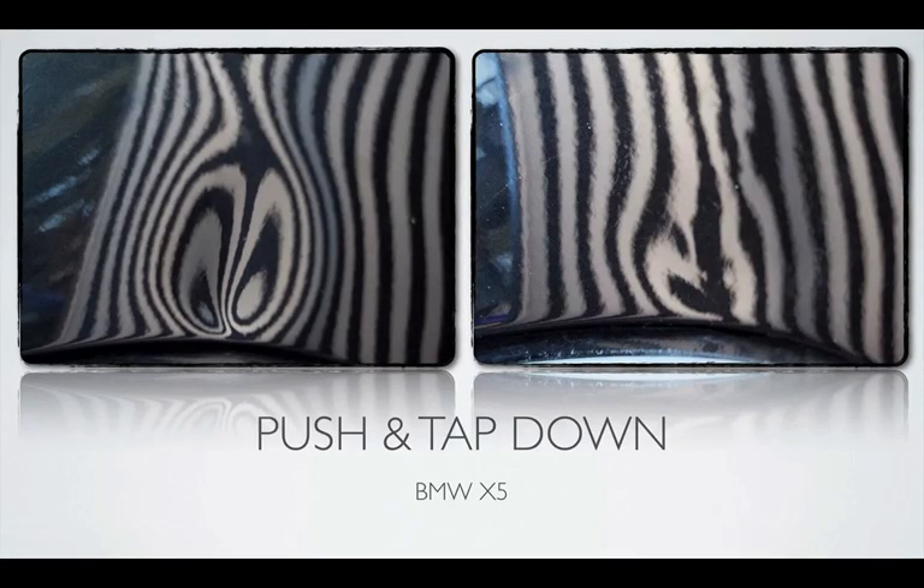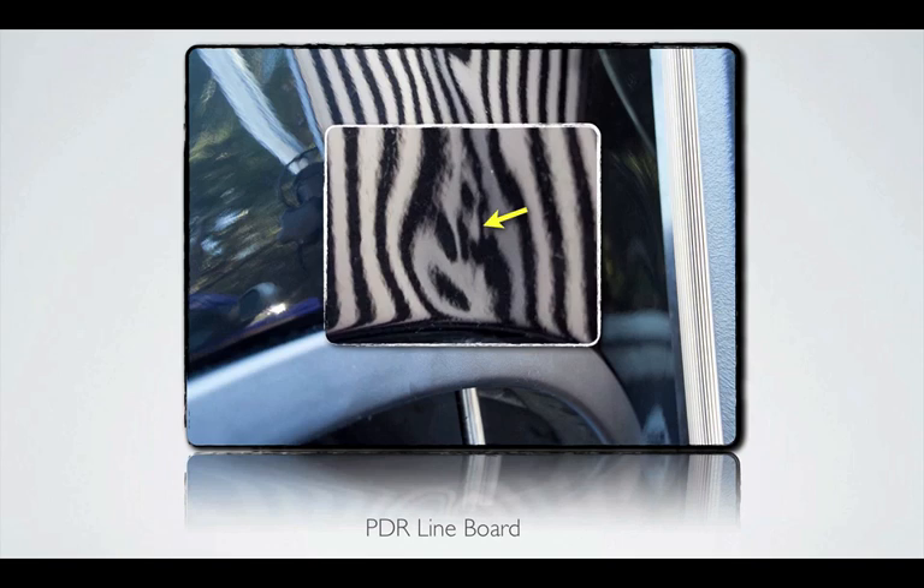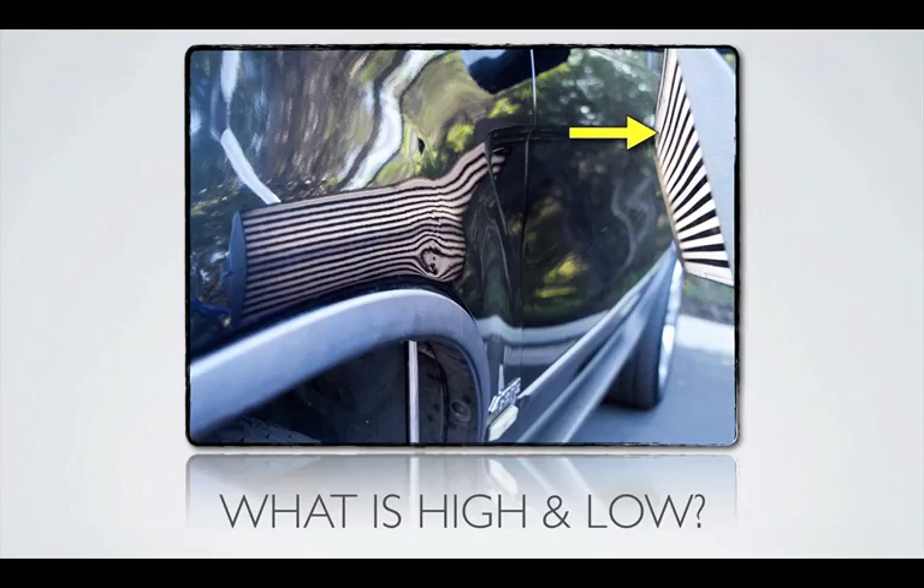On the next slide you can see that I did a little bit of both — I did knock down. You can see a little tap-down marks if you look closely right around that area. But notice that the line is more symmetrical, it's straighter, it's not as pinched, it's not as thin. Anytime you have a skinny high spot like the black line with a little bit of whiteness on the left, that's telling you it's mainly a high in the middle of a low horizontal.